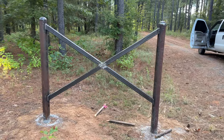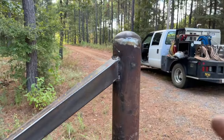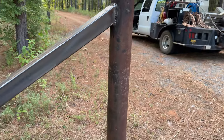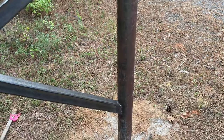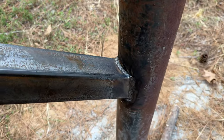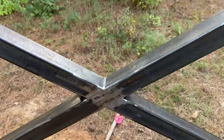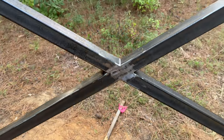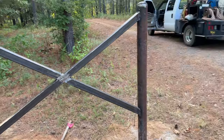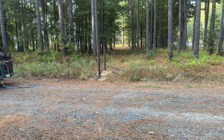So the X is square and figuring this out was kind of a trick. I've never done it before, so the top one's kind of rough. There's a big gap there. Had to do some slugging — they call it — maybe I'll show you how to do that later. But they started getting better, started cleaning up and looking really nice. The X was at 56.8 degrees and that worked out good. So I'm going to show you how to lay that one out and maybe cut some time off a project if you ever have to do this.